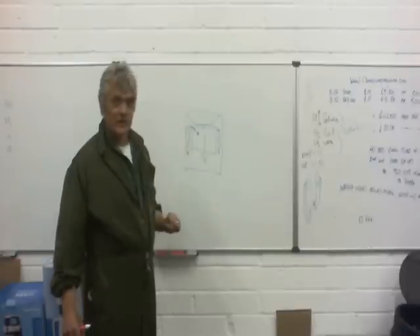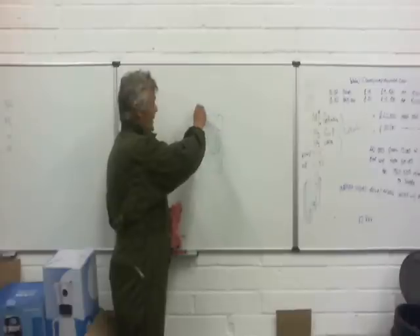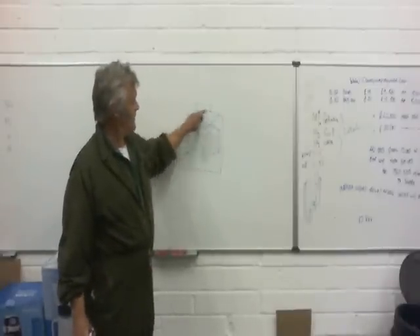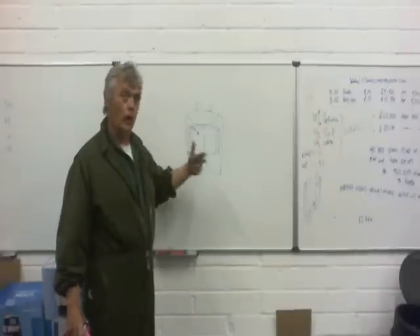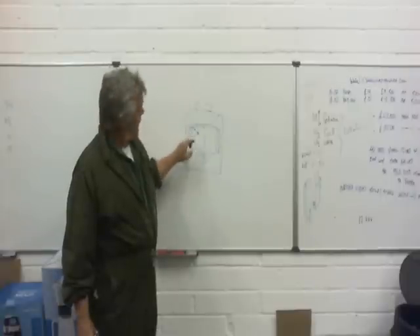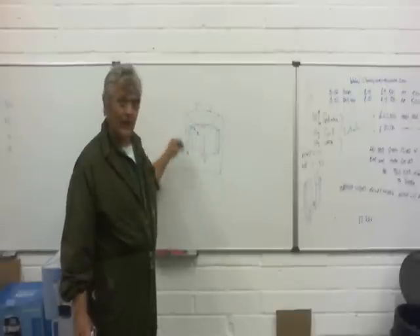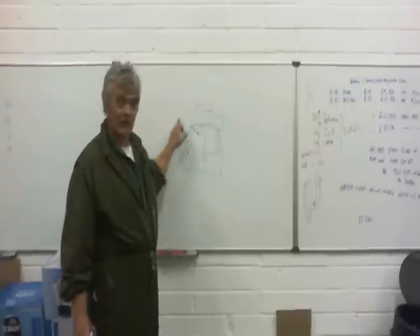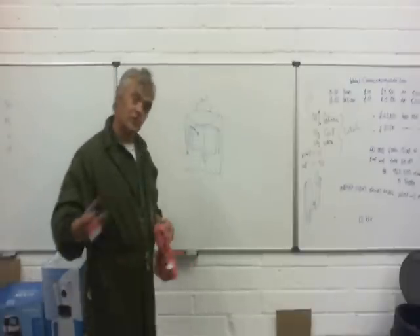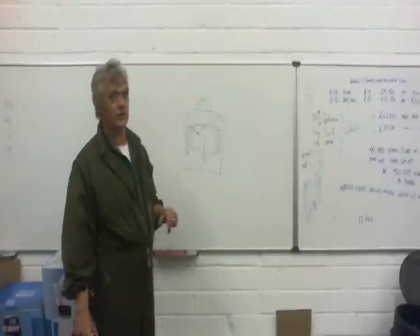Now it needs a 90-degree angle, and that 90-degree angle is taken care of by the fact that the hole is very small. If you made a very big hole, it wouldn't work. A small hole means that there's a delay — it takes time to force its way in there — between the lowering and raising of the displacer and the lowering and raising of the balloon membrane. That is really key to it working. You can remember we put a weight on here. Putting that weight on there means that that displacer and that membrane have to do more work to raise themselves. If it needs to do too much work, the displacer will go into there far too quickly and the air won't get hot enough. Too little, and it will raise itself very readily. So that weight is critical to the tuning of this particular device.